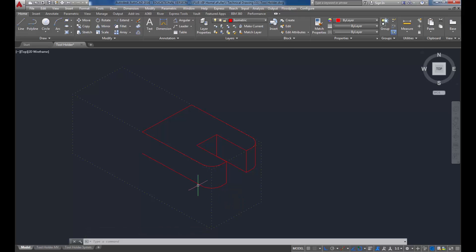This line right here is shorter than the rest. I'll use the copy command, select this construction line, hit F5, and copy it back a distance of 2.75. Now I can trim to that 2.75. I like to trim and delete construction lines as I go - it makes things more clear and keeps the drawing as simple looking as possible. I've done my 2.75 offset to get the length of this line.